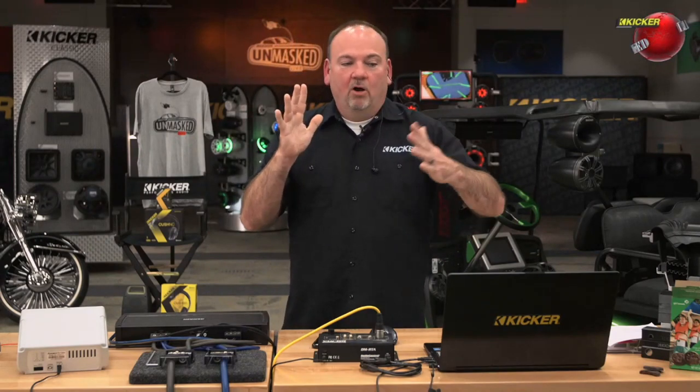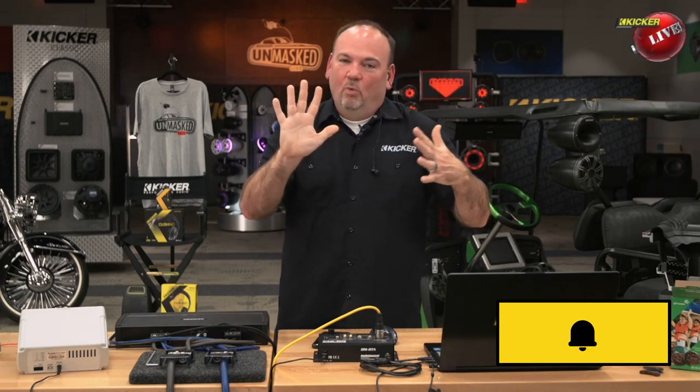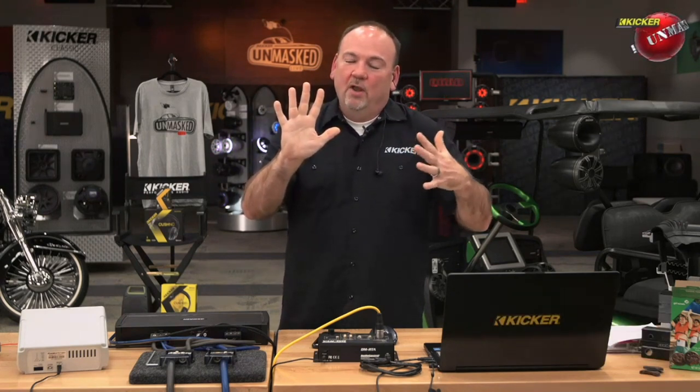Doing it the old school way — we're actually driving the tone in there. You can see when you get to tuning, the passive radiator is doing all the work, just like a port would be. And the speaker is barely moving. When you start going below that tuning frequency, the passive radiator keeps moving but changes slightly, and the woofer starts doing a lot more work. Then you get back to that point where it's tuned — the woofer hardly moves and the passive radiator is doing all the work — and then start climbing in frequency, the opposite starts happening.